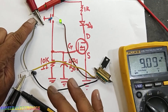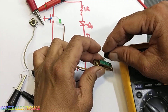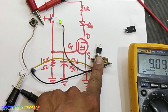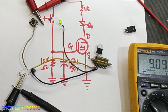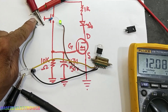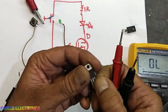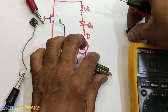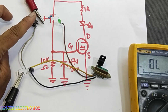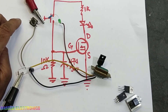From 9V to 12V this circuit works nicely. Now I have a 4N60 MOSFET — I connected it and it is also short circuit. At 12V, whether you press the button or not, the LED is on the same, because it has a drain-to-source short circuit. This is the good MOSFET working correctly. I hope this video is informative — hit the like button, let me know your questions in the comments. Thanks for watching. Assalamualaikum warahmatullahi wabarakatuh.